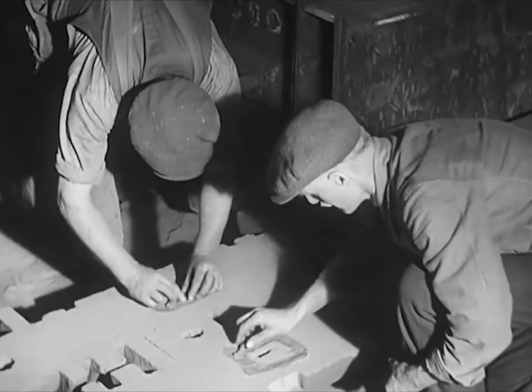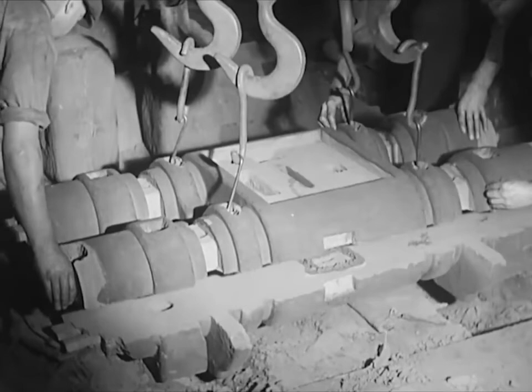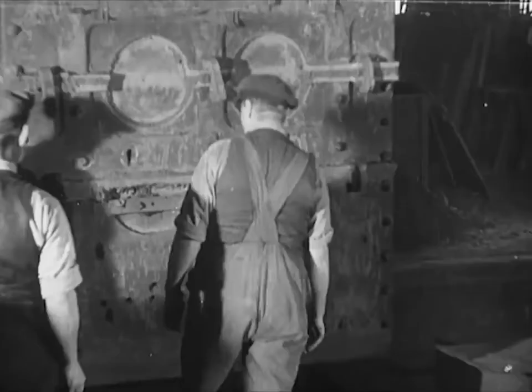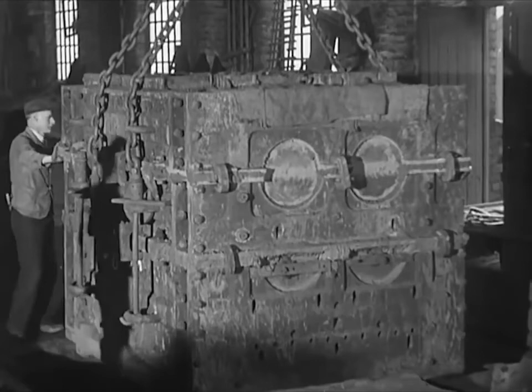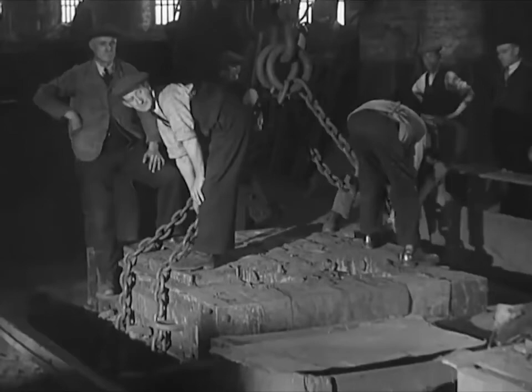Foundry work is rather paradoxical — it is what isn't there that matters. A mould eventually consists of an ordered assembly of spaces into which the molten metal is poured. Over 60 moulds and cores are required to make a pair of inside cylinders for our engine. Skilled workmen fashion them in sand from patterns made of wood. The assembly of the cores in a mould is a task something like fitting together a giant jigsaw puzzle. A twelve hours drying causes the sand to assume a consistency which enables it to withstand the great pressure of metal soon to be placed upon it.